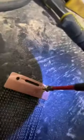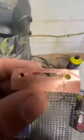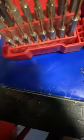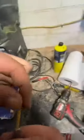Do they make it? I think they might just screw through. All right, we're gonna give that a shot, but I need two hands, so. So indeed, we'll do some old-fashioned, not approved for maintaining your screw thread boring to get these holes a little bit bigger. I'm gonna go ahead and find my marks. Okay, I'm gonna find a drill bit that is just a tiny bit smaller than these threads. Let's see here. Yeah, looks like 1/8 is my huckleberry.